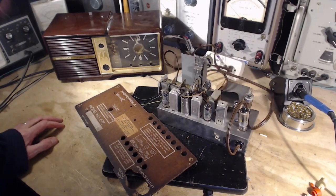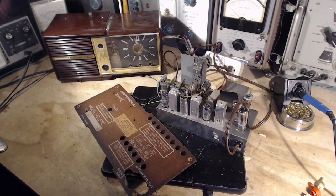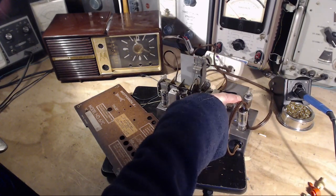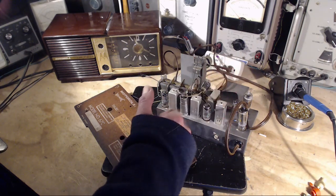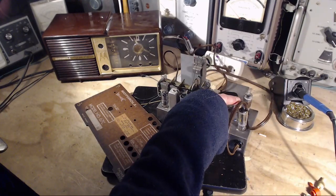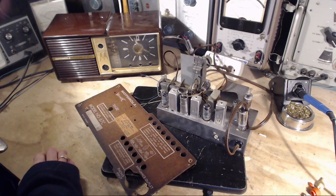Welcome to the shop. Someone sent in the proper schematic for this radio, so I'm going to spend some time going over it, running through it as best I can, and identifying what's going on. I want to think about what could be causing low output aside from the 12CR6 tube, which looks weak and is probably the cause of the low audio — but maybe not. I don't have a replacement for it anyway, so let's look at the schematic and identify a few possible causes.